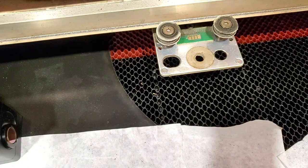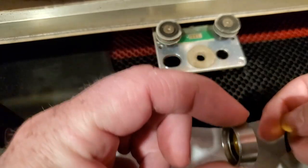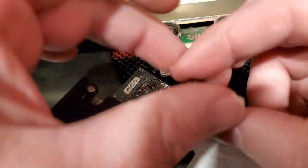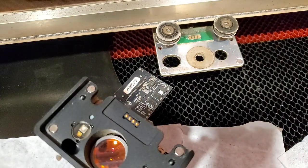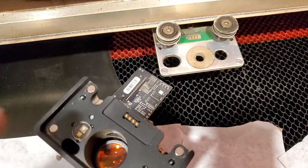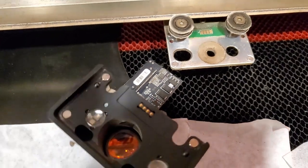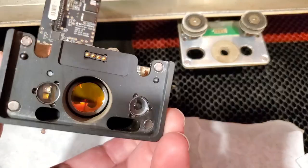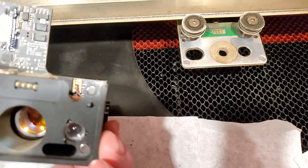I clean these lenses multiple times a day — probably two or three times a day if I'm using the Glowforge a lot. When you put the lens back in, there's an arrow on the side; that arrow faces into the hole. Drop it down and push it in with your tool. A lot of new users will say 'my lens isn't staying up at the top where it's supposed to be' — well, it's not supposed to. That's how it focuses. The lens rides up and down in that tube as the Glowforge focuses.